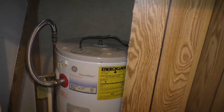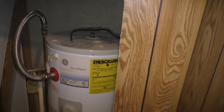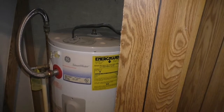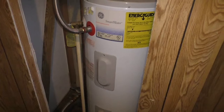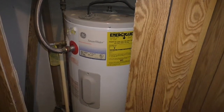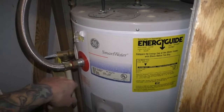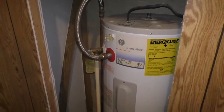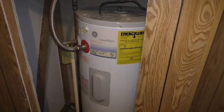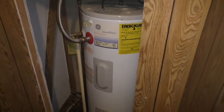You've got to shut off the electricity at the circuit breaker for your water heater. I shut off the water outside. I attempted to drain as much as I can — I opened up a faucet in the master bedroom on one end of the trailer, and then I opened up the faucet in the kitchen as well to reduce pressure in the lines. I also started unscrewing a nut from the three-quarter water line to relieve some pressure. I'm going to get my dolly in here and try to get this old water heater out without draining all the water. It's Sunday, my only day off, so let's get started.